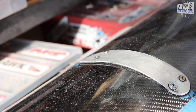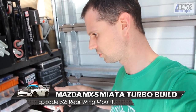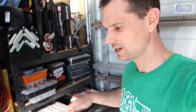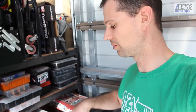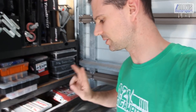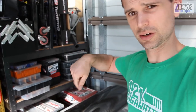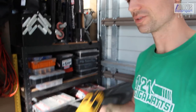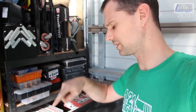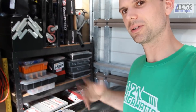The wing has now had a day to dry and all the Sikaflex has dried up. What I'm going to do is pull out the screws that were purely for securing it while it dried. I need to drill holes from the bottom all the way through to the top. To do that properly is a little tricky because I need to make sure the holes are directly parallel to one another, otherwise the bolt holes could go skewing off all over the place. So I don't really want to do it with my hand drill. I'm thinking of rigging up something to hold the wing level and do it with a drill press, so that everything's more square and the holes line up on the other side once we flip the wing over.